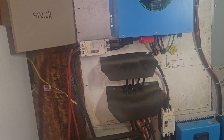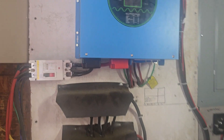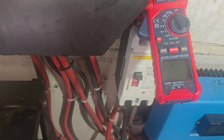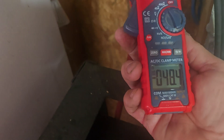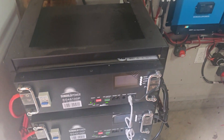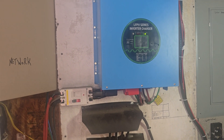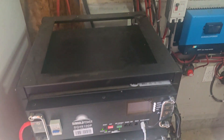Today is the 4th of July. It was charging earlier, but right now the sun's not even out — it's cloudy. Right now the system's putting out 41 amps at 48 volts, and the house is using 48 amps, so it's just going to keep even until the sun comes out and starts charging. So what we're going to do today is add two more batteries, which will get me roughly five to six more hours of run time at night — we're running air conditioners in summer and heaters in winter. That'll help immensely.